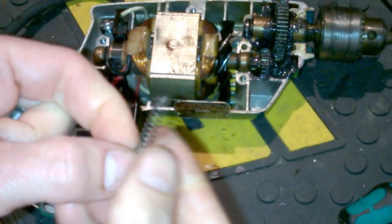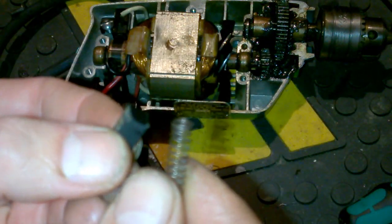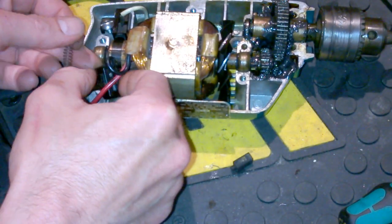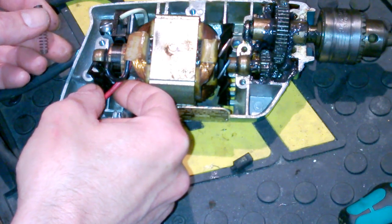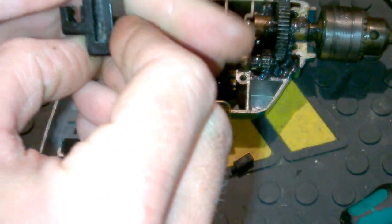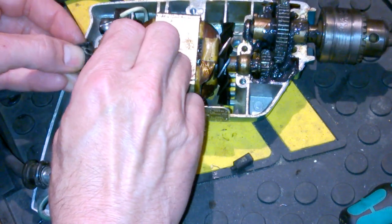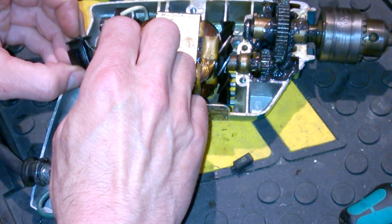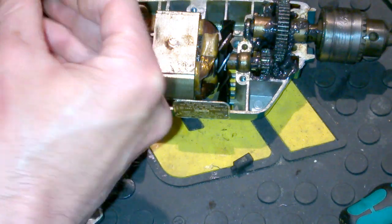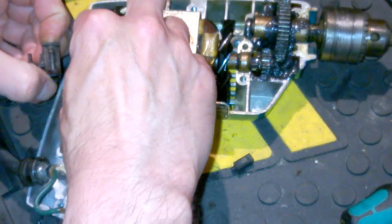Just wanted to show how we install the brushes. We've got a spring, a screw to hook it to the housing, and the brush itself — probably two-thirds of the original brush left, so I'm going to reuse it. There's a black housing: the spring goes in there, you push the brush in, and there's a little hook that goes in and hooks onto the bottom of the brush. That little nubbin keeps it from popping out, while the spring provides tension so it's always pushing against the rotor. It's a little hard to explain — let me try to install it for you. It's a little bit tricky but we'll get it done.